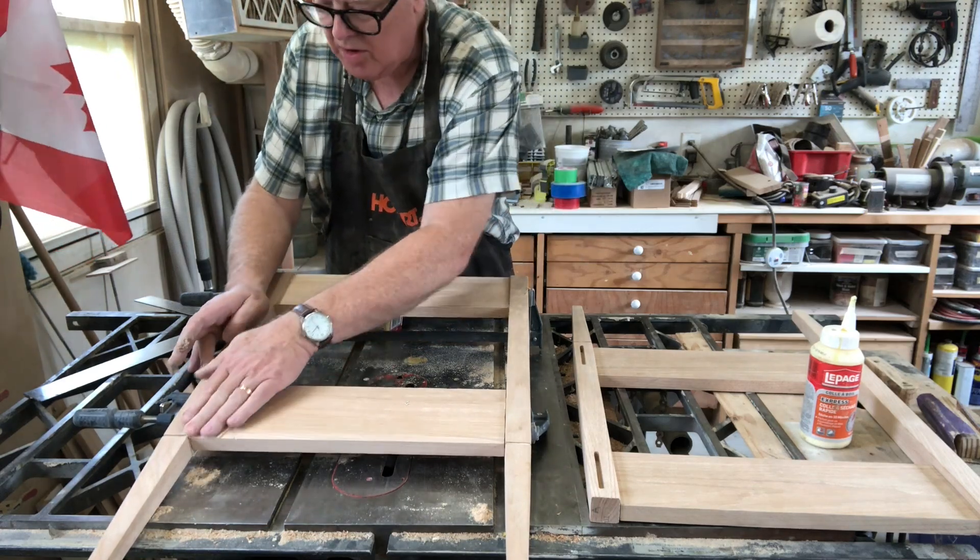So I'm going to do one table at a time. I'll bring over the drawers and we'll get them glued and clamped together. So I'm just disassembling the dry fit — this is a snug but not hammer-tight fit, which is what I was going for. The order of operation will be to glue those two dovetail joints in. The alignment is this surface matching flush with that surface. Once those are in, we'll slip the drawer bottom in and then glue up this top finger joint — box joint. I've been calling it all kinds of things, so I hope you'll forgive me for being inconsistent. I think I've even called it a box tail — confusing with dovetail. So apologies for that.